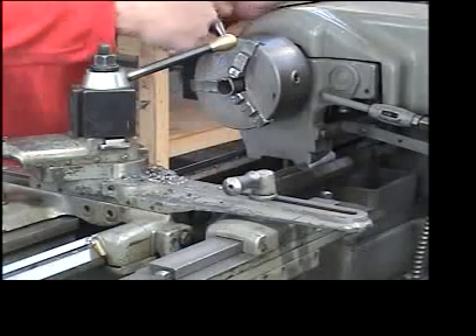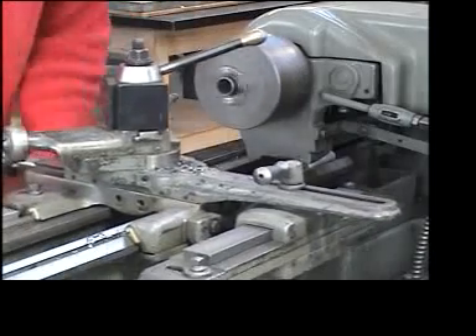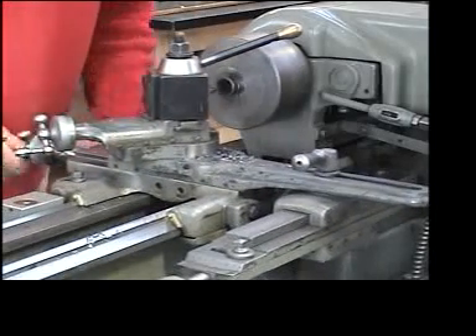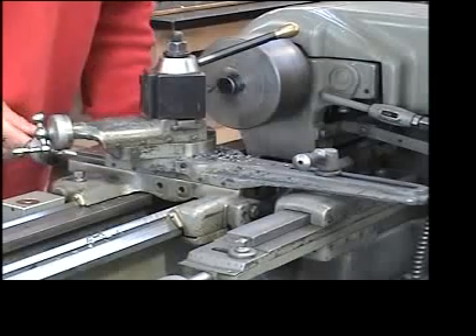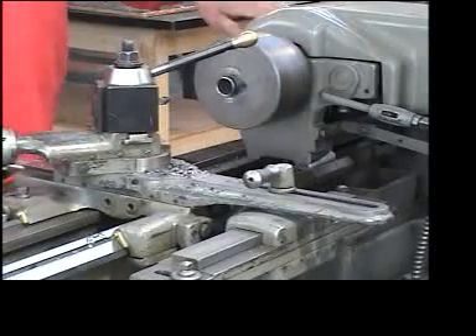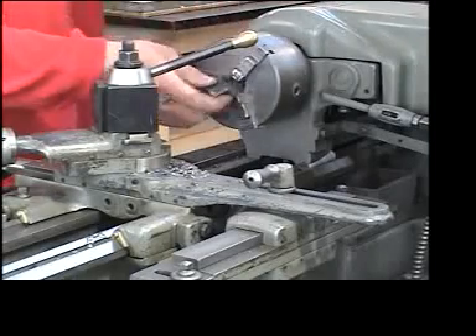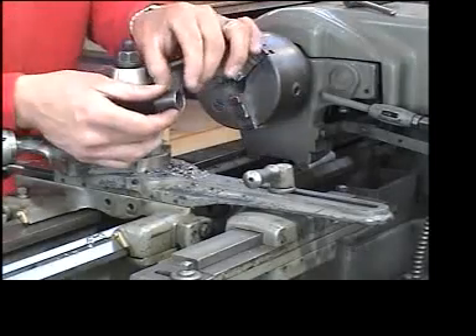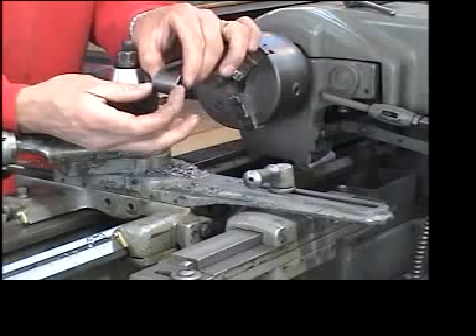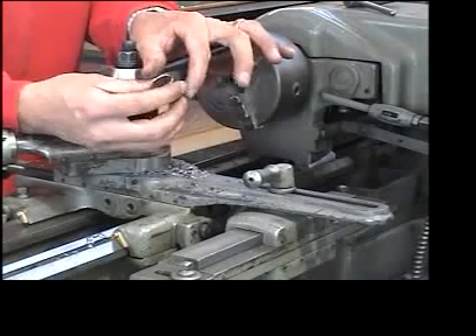In this situation I'm going to flip it around and do the other side. I'll leave my tool post the way it is, take a light cut off the outside, remove all traces of the saw marks. Now with both sides done, if I take a ruler and measure one side and then the opposite width, they'll be identical — exactly the same.